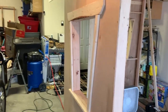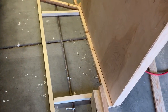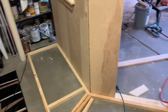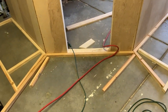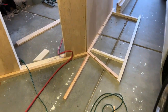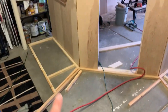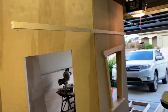Some other stuff I've been doing: I framed up another window here and I'm kind of laying out some sections for this bottom deck. I'm going to have a deck with some boards to be kind of like a boardwalk that goes around the outside. I got all the pieces cut except for my last piece out here. I kind of mock it up first before I put everything together just to make sure I get the angles right. And I did something similar with one by fours to go up here for the roof deck and the balcony for the second story.